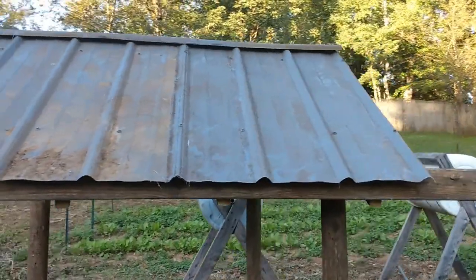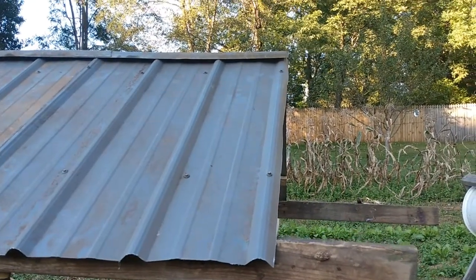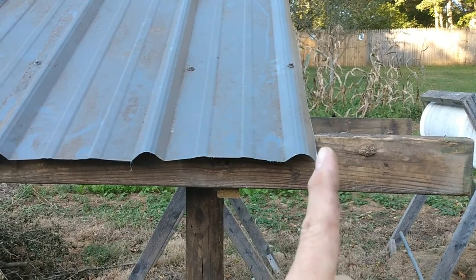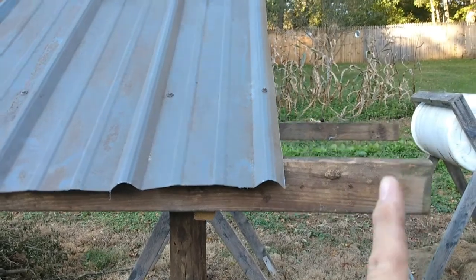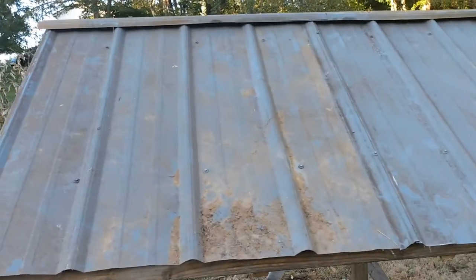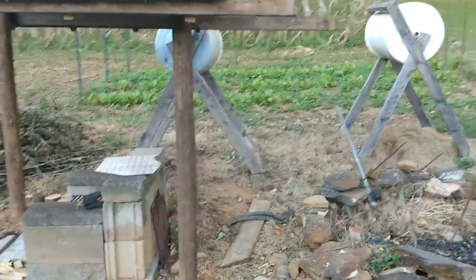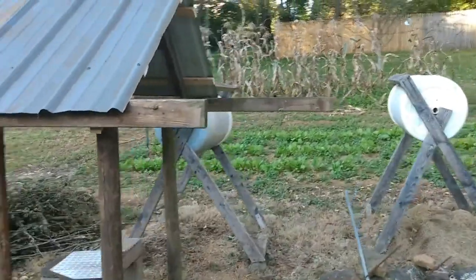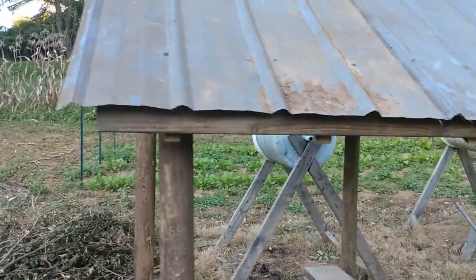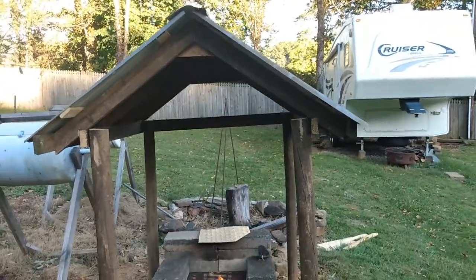And what I did was I cut this piece right along that rib, which gave me 1 piece. I cut it from there to there. It would have went on over, and I used that up on top and made a homemade ridge cap. And it worked out perfect. I got about a 6 inch overhang thereabouts, and I got to cut those 2 off. They're sticking over a little there, and I think it's going to be good. We'll see if it keeps the weather off.